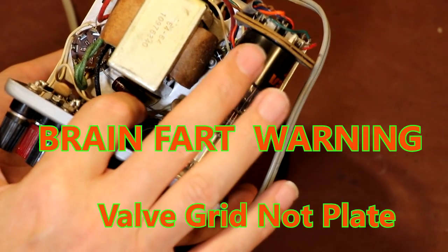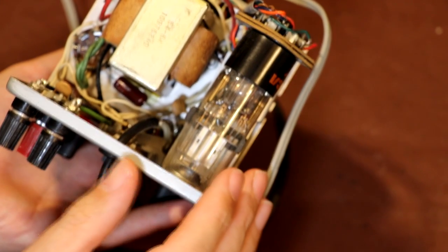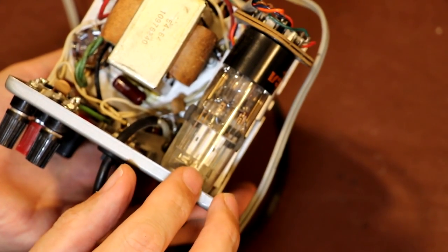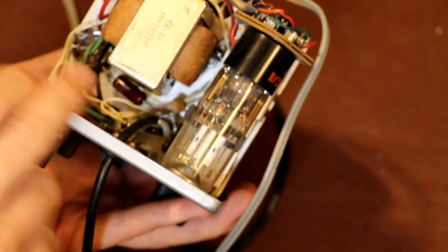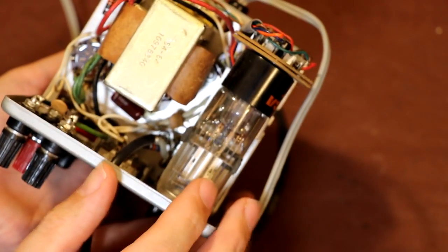So I would typically replace these on site, but it isn't a waxy capacitor, it's something much more modern than that. So what I think I might do is we'll just power this up and we'll do a DC test on it. We'll just measure, and typically you should find 0 volts. You certainly shouldn't find a positive offset voltage on here, so we'll give that a try as well.